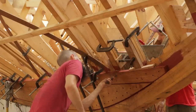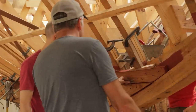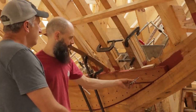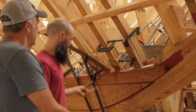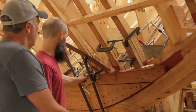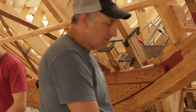Using a caliper for measuring: it should be about an inch and a quarter from the edge. On the stem we want to space the fasteners about three inches apart give or take, and as we go aft we space them out more. It was more important for the garboard — at the frames they just get two bolts through the frame, so that's easy.